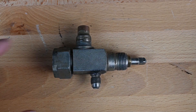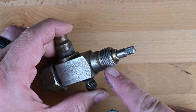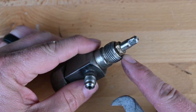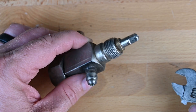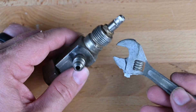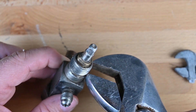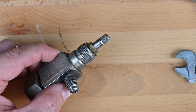Not all three-way service valves are the same. Here's an example of a commercial one, and what we have here is a packing nut or packing gland. It's very important to loosen this before we operate the valve stem, otherwise we could strip it out. There are several ways to do it — one is a small miniature adjustable wrench, or a full-size adjustable wrench, but the problem is sometimes it's hard getting it into a tight fitting.